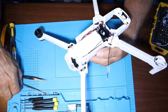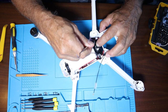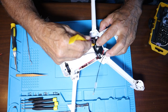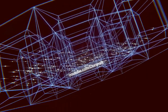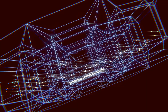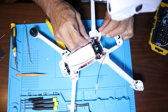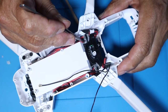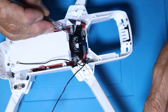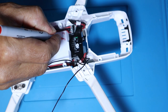I think the problem is that the power control board must have taken a beating when it landed really hard on the pavement. Now it's time to remove the silicone from the arm I have to replace. It's time to remove all the silicone from the solder joints — there are four of them. I'll write down the order of the way the wires are soldered on just to make sure I put it back the same way. I use color sharpies — red, black, red, black — to make sure I don't forget.